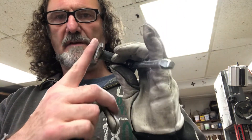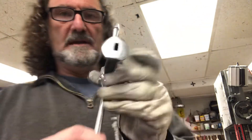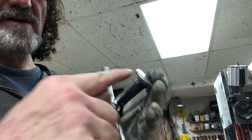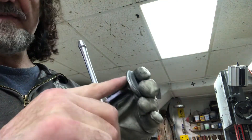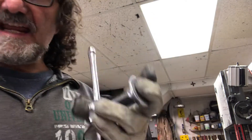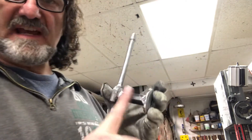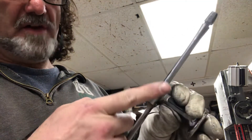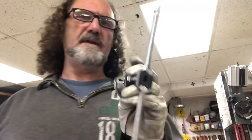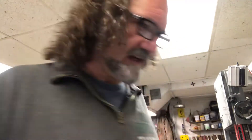Now I'm getting in here with my die grinders and grinding out the welds so it looks nice and smooth. I'll probably also start taking off a little bit of weight on this - I'll actually come in and sand this edge here, and probably also bring the head block down a little bit. It'll probably be just wider than the actual handle itself.